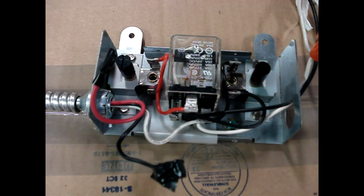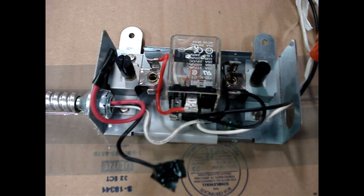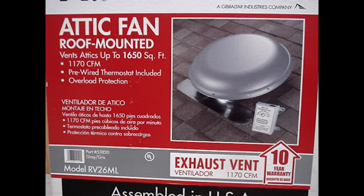If you don't have a multimeter to check the output of the controller and you have tested the fan motor and it won't run, odds are probably pretty good that both parts aren't bad, and you can go ahead and buy a motor. In my case, I couldn't easily find a replacement 2-speed motor. I bought a new attic fan made by the same company and just pulled the controller and fan out of the new one and retrofitted it into the existing housing. The cost for the whole new unit was only about $15 more than the going rate for replacement fans.